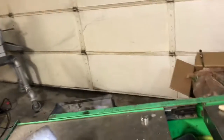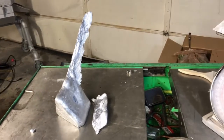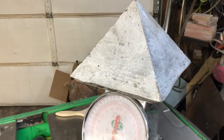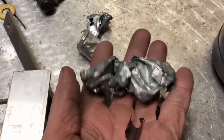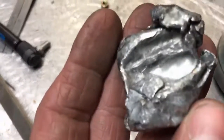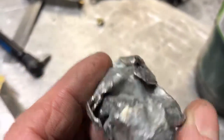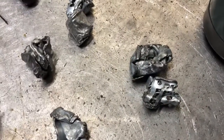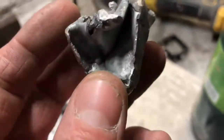That's still pretty incredible — we did this in about 15 minutes or so, maybe not even that long. You saw how long it took to get that one piece started. It was probably about 20 minutes after that when I finally shut it down. Things were already melted but I was deceived by this material in the aluminum bin — there was a significant amount of steel mixed in. As you can see, this is aluminum — but this is not. That is steel, some kind of galvanized or anodized steel with a layer of something on it. And I threw a huge pile of these things in thinking they were aluminum — that's what we saw glowing in the crucible.